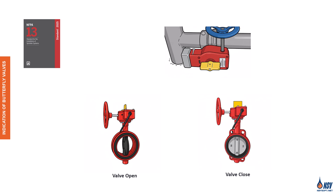It's also important to note that the disc of a butterfly valve can extend beyond the valve body when it's operated. Because of this, designers and installers must ensure there is enough clearance around the valve for full movement. Placing elbows, tees, or other fittings too close can obstruct the disc, preventing it from opening or closing properly.